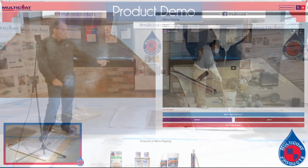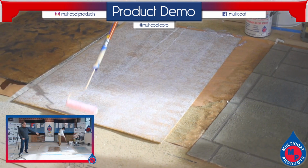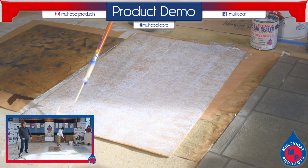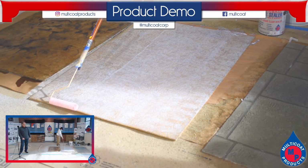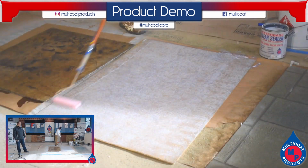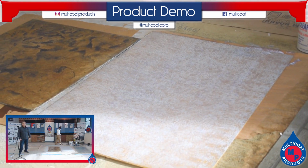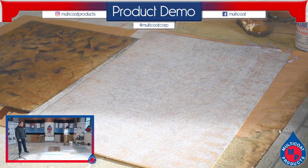And then going back to the sealers, as you see Alfonso over here. So you could use any of these sealers on our microtopping, more likely the water-based, because of its interior. Has very little or no smell, the water-based sealer. The solvent-based one, you get some smell. You'd probably only want to use it exterior.